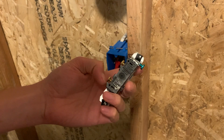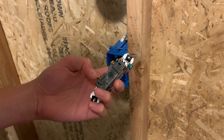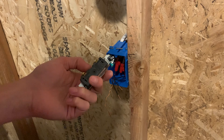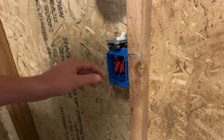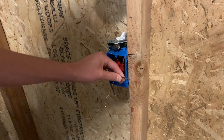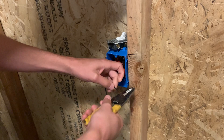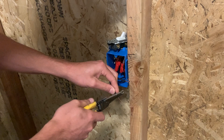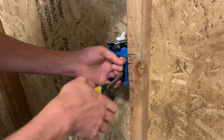Depending on your switch, you can either stab it in the back through these holes, which I don't really recommend — if you have a problem, it's more work to get it out. It depends on what your company wants. If they want you to strip and curl it, go ahead and do that. If they want you to stab it in, then do that. I'm actually going to curl it for the sake of this demo. If you were going to stab it in, do about a half inch and just stab it in the back. If you're going to curl it, I like to do a little bit more — about three quarters of an inch — so you have all your copper exposed and no insulation under the screw. Not too much, like an inch. About three quarters, and worst case if you want to tape it, you can do that if you're using a metal box, but in this case we're just doing a residential situation.